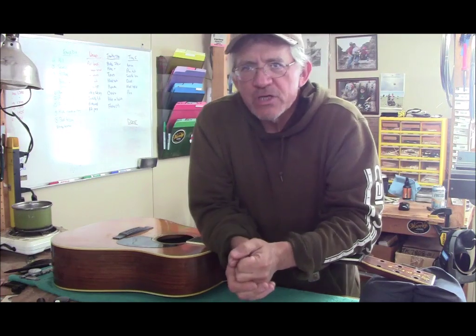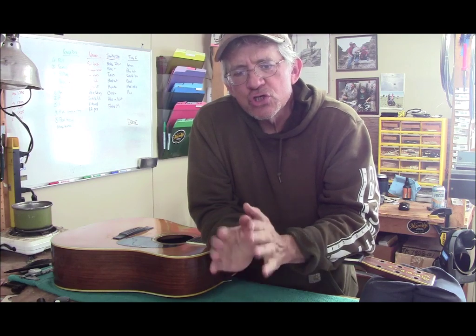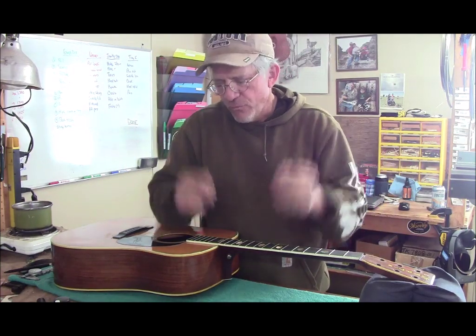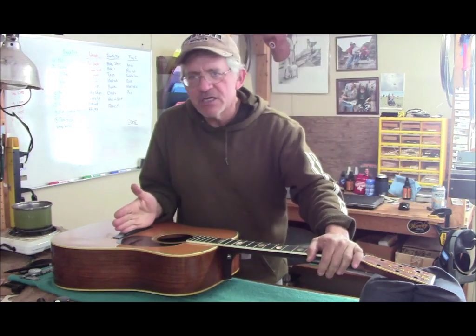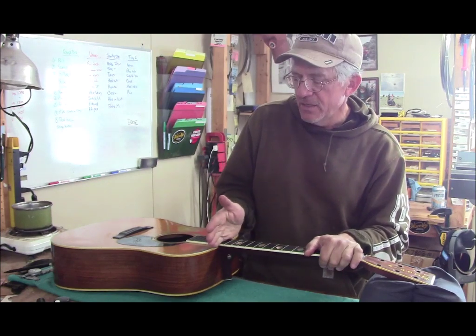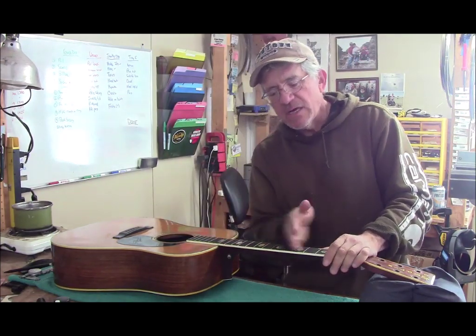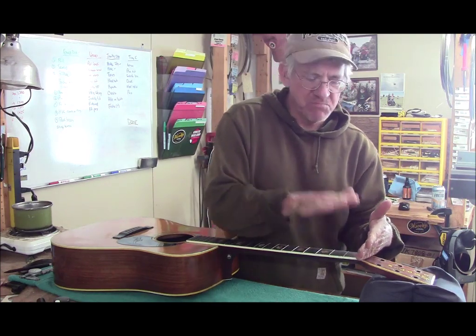The purpose of this video, one more time, was for you to know what to look for when you're buying a used 1970s Martin 14 fret dreadnought. The first thing you're going to do is check the bridge location. The second thing is to check the action at the 12th fret and see what you think about that. Then, if it's good, you're great, you're done. I would check the neck relief, regardless. I would check the neck height, regardless.